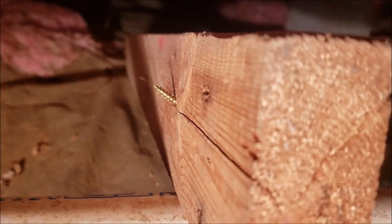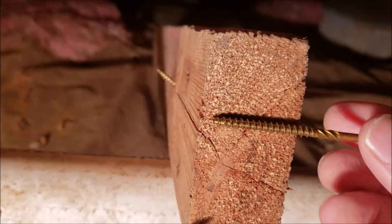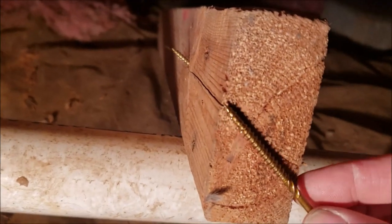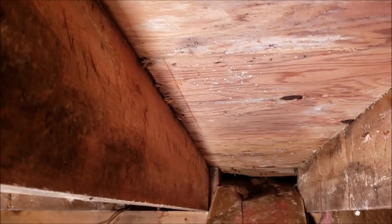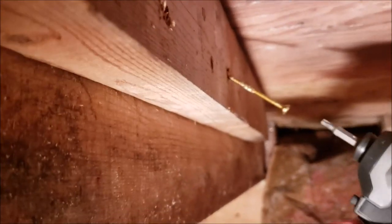Here's my simple plan. I've already pre-drilled some holes, and my goal is to run this screw up at an angle, because the plywood has kind of flexed down and I want to push it back up. Instead of just shooting the screws straight through the side — sometimes if you happen to get a gap, you've still got the flutes digging into the 2x4 — by pre-drilling the hole, when the screw goes through it's going to push up, raise this up and wedge it tight, and cinch it right against that floor joist good and snug. I pre-drilled about 6 holes all the way down, all going up at an angle. I think this is going to do pretty good.